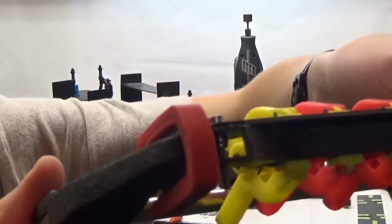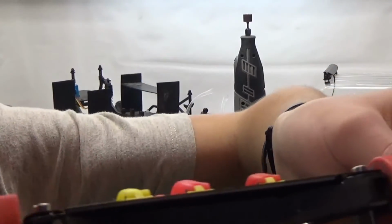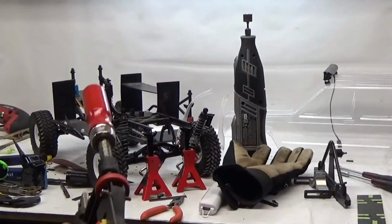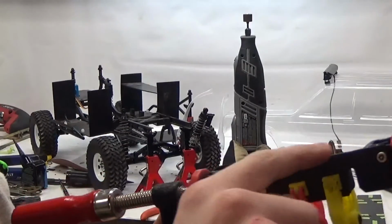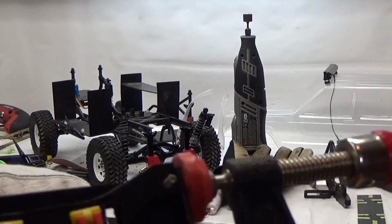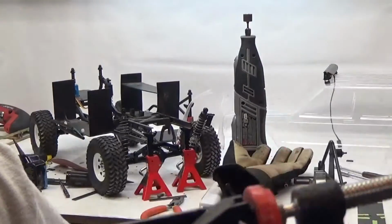I trimmed them on the outside, and then I went ahead and bent this around, and then you'll see I got a screw and the nut in there to hold this furthest back piece against it while it's gluing, and then I got a couple clamps holding the main section back there. After this hopefully it'll be plenty strong. I may end up trimming this down too, but I'm not sure how low I'll be able to go without it becoming weak again. I've also thought about putting another one of these styrene plates along the front edge here too, just to make things equal on both sides.